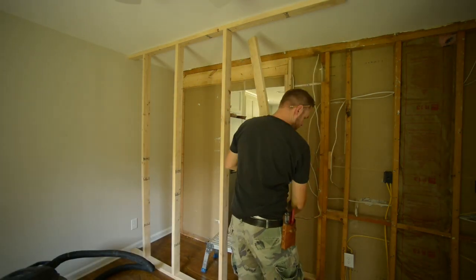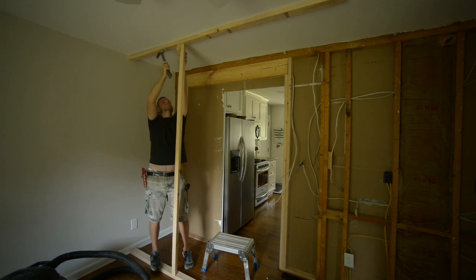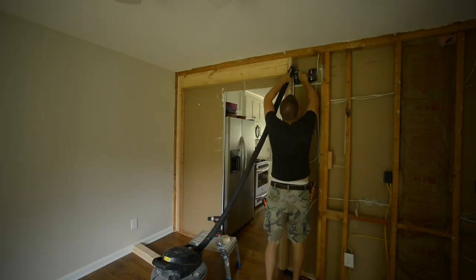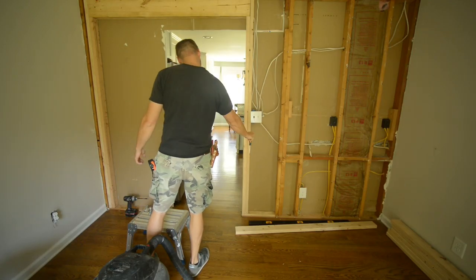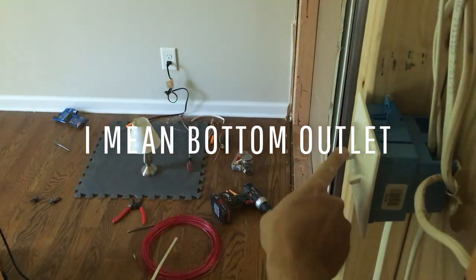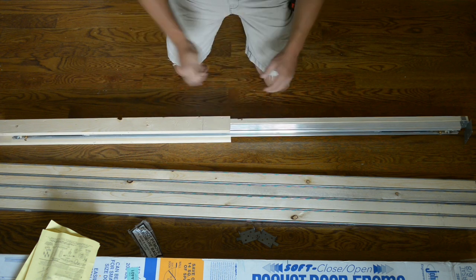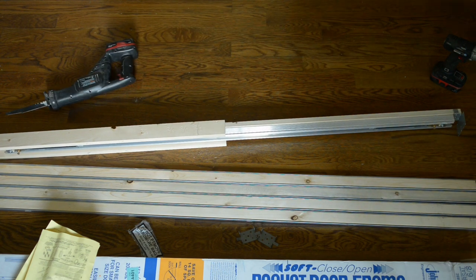The header's done. So now I can fully take out the load bearing wall and get to work on the other stuff. Just drilling through - I had to move one wire up through the attic and back down. My wife wanted that outlet to be switched, so there's a way you can run wiring where the bottom outlet turns on and off with the switch. We didn't have any overhead lighting in that room and we're not planning on having any, so I made that a switched outlet. You can do a search on YouTube - maybe I'll put a link below on a good video to show how to do that.